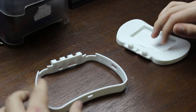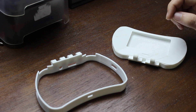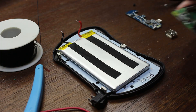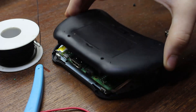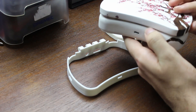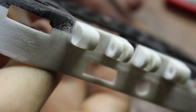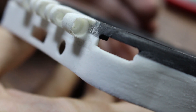With the hinges done we can start designing the final case. The final casing is actually only three parts: the bottom part, the back of the screen, and the top screen part that gets glued on. We're reusing parts from the original keyboard casing to save time and plastic. On the final unit you can't even see where the division is — you can only see the USB holes — because we ended up sanding and painting it. This saved a lot of time: instead of redesigning where all the key holes go, we just take that top piece and glue it onto the printed piece.